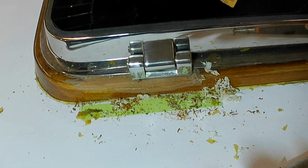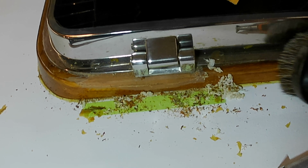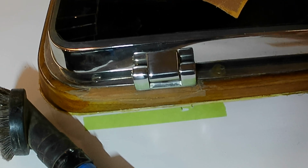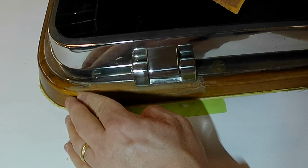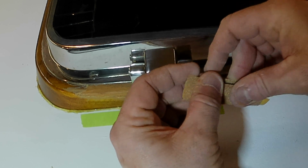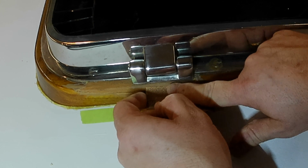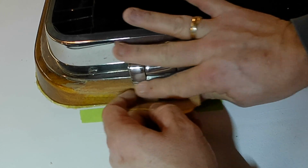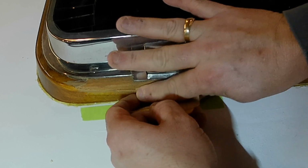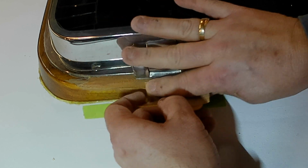Okay, so loud noises here. I'm going to turn the vacuum on. Okay, so that's nice and clean now. So now I will take the sandpaper. This is the 60 grit and kind of go over it to raise the grain. I will go over this again with 100 grit to knock down any high spots that this leaves. But this is just getting what the scraper couldn't get.